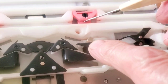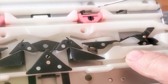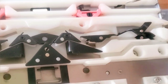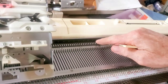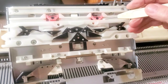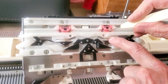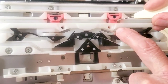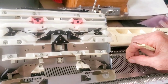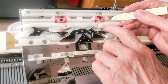Notice here: when that goes back against the spring pressure, it pulls out this stopper. In its relaxed position, the spring pushes it forward and there's no impediment for a needle butt to go right through. The back section of the bed is where this goes, so needle butts come right through here. The needle butt gets to here, presses this up to go by, and that brings this up — which is part of the lace knitting, because it impedes the needle here. So you've got needles in two positions: out here and in here, coming from each direction. This lifts and diverts the needle butt.